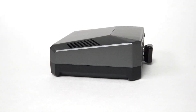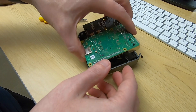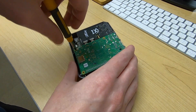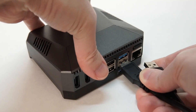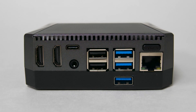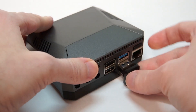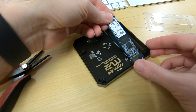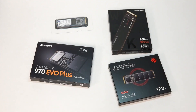There are a lot of Raspberry Pi cases out there that you can print or laser cut, but none of them have all the features of the Argon One M2 for the Raspberry Pi 4. The aluminum case provides passive cooling by acting like one massive heat spreader, and there's a daughter card that routes all the ports to the back while also converting the HDMI micro ports to full-size HDMI A ports. There's a removable hatch for access to the GPIO pins and a power switch on the back. There's also a USB 3 dongle that connects the Pi to an M.2 connector at the bottom, letting you add storage — though not every M.2 type is supported, and Jeff breaks down what works and what doesn't.